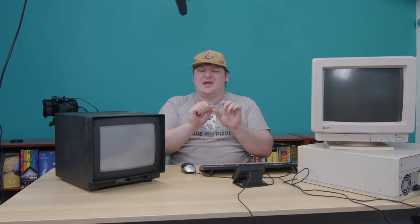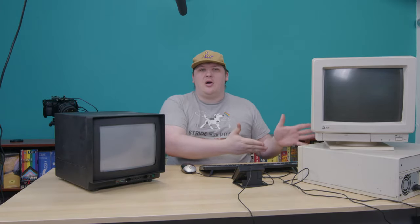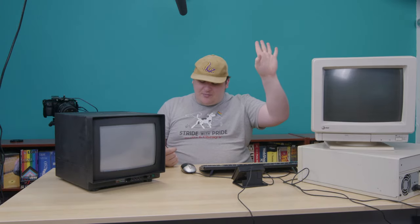When they got to VGA, that's one of the things they did. VGA doesn't actually need more pins than CGA, because it's just RGB, HV, and then, you know, power and ground. You could absolutely, and there are things that do this, put VGA through a 9-pin connector. But they went to the 15-pin partly because it allowed them to put identifier pins in there, so that the monitor could signal by bridging certain pins which type of monitor it was, and thus tell the card what type of video to output, if I remember this correctly. I believe that's how it worked. Eventually, this evolved into EDID, where it actually sent data over those pins. But originally, it was just a series of bits that told the card what to output. But there was no room for that in CGA, because they hadn't provided for pins on the connector for it.